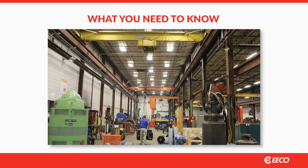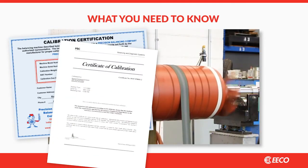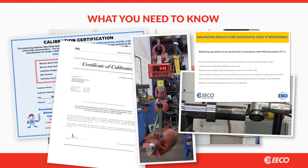Second, visit your shops and take a look for yourself. You can quickly and easily inspect for a certificate of the balance machine by an ISO qualified lab, a certificate of calibration to ISO 1940, a convenient means of weighing rotors, shaft stops to control movement while not introducing force into the assembly during the test, and a written balancing procedure referencing the ISO 1940 standard.